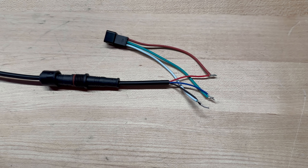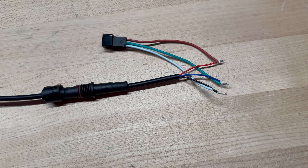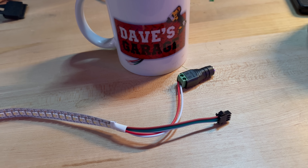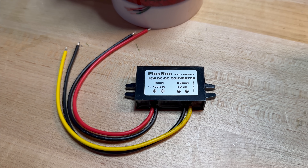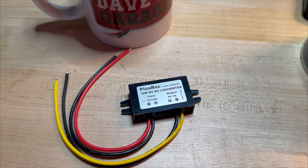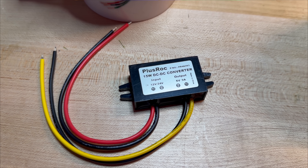To make the physical connection, I had to cut the cable coming out of the plate frame, which was a little scary. It's a 3-wire connection with power, ground, and data — and thankfully the wires turned out to be red, black, and blue, which makes it easy to sort out. I spliced in a dedicated 5V power supply, because even though there are only about 40 LEDs in the plate frame, at bright values they'll draw a lot more power than the ESP32 can supply from its internal regulator. For anything more than a small handful of LEDs, a separate power supply is essential. For installation in a car, which is nominally 12V, you need a 12V to 5V buck converter — a simple little module that connects to your 12V circuit and produces the constant 5V you need.